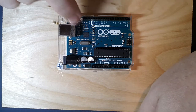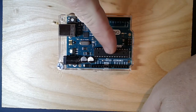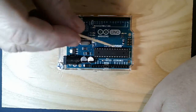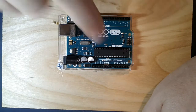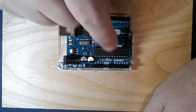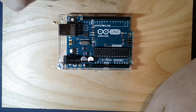There's also a reset button that can reset the microcontroller. When the microcontroller powers up, it automatically has a circuit that causes it to reset and start from the beginning of its program. But you can interrupt that and start over by pressing the reset button. The processor also has a power-up circuit when you first power it on or after you program it.